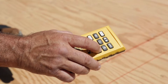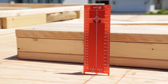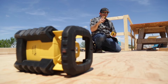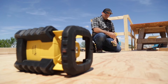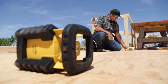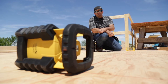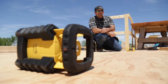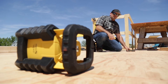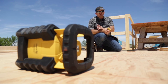I'm going to use the remote control. I'm going to hold down the Y — that steers us left to right. As I twist my wrist, it's going to move the dot. What I'm going to do is split the dot right on the line of the reflector. This establishes our first control line. Now we'll go pick up the rotation beam using our receiver on the long wall. We're going to drop this down on our second set of walls — this is the long wall going across the back of the house, roughly 120 feet long. I'll place my receiver directly on this snap line. Solid tone — that means this wall is perfectly square. We originally did the layout with the LER-350 for the interior partition walls. As I move the receiver left to right, it has an arrow increment that shows you which way to go, left or right of the control line. It's a fast way to establish the square at long range. Remember guys, this has a working range of a half a mile if you're shooting horizontal — that means diameter range of the job, place the laser dead center, and you're good to go. Thanks, guys.